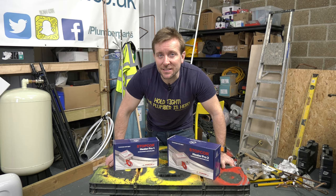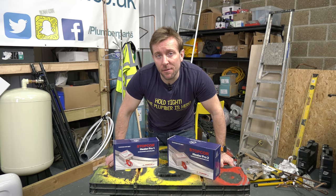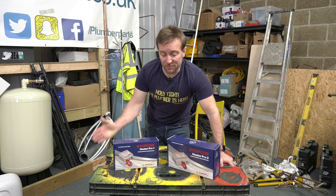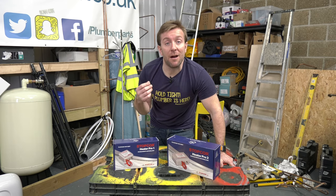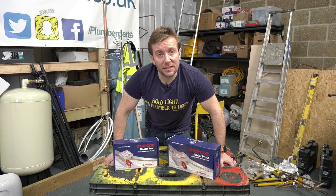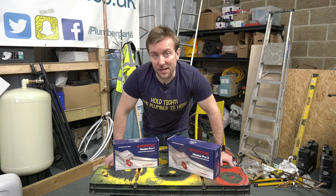Links below. So what does Stopcor do to protect your heating system from corroding, but also at the same time, all in one product, slows down the buildup and formation of limescale on products and bits inside the system? What I mean by that is it's going to reduce limescale buildup in plate heat exchangers on combi boilers. It's going to do the same when it comes to the outlet on taps, shower heads, washing machines, anything that's connected via a conductive metal or a water supply that goes back to this will feel the benefits of having a Stopcor, basically protecting the whole system.